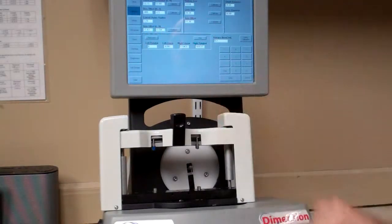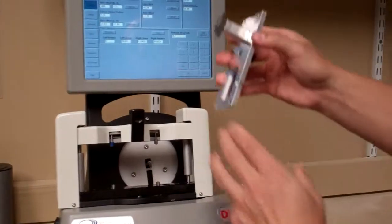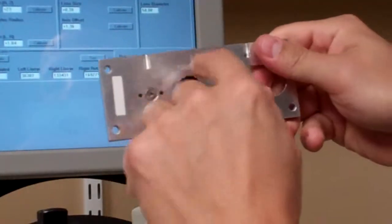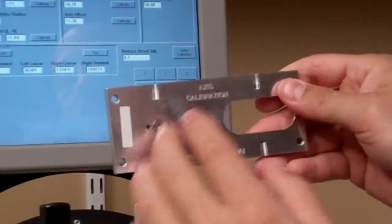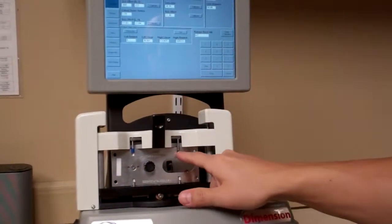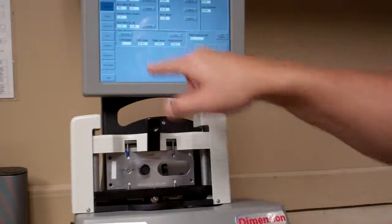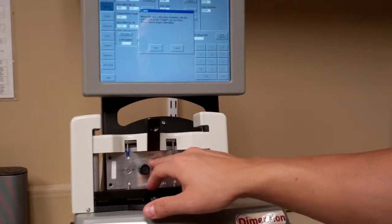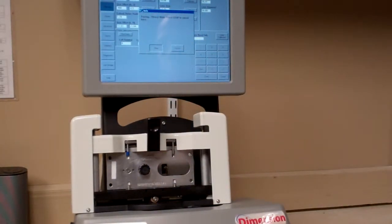Skip over that and go to Axis Offset Left and Right. You'll need the second tool from your kit — on the front it says Pattern Lenses, and on the other side it says Axis Calibration. Orient it with Axis Calibration facing up and place it in the machine just like the last plate. Hit Calibrate, confirm the axis shape is in the right eye position, and hit Start. The stylus will come out and trace — it usually does it in one pass, sometimes multiple passes depending on how far off the machine is. This calibrates the axis for metal or plastic frames.